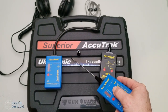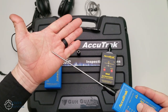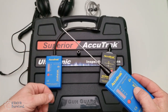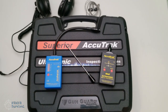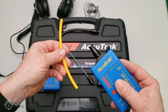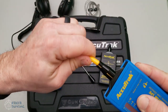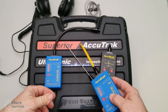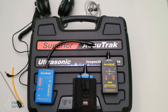With the stethoscope attachment you're able to check TXVs to verify they're feeding correctly, check steam traps to see if they're letting steam through, and check the bearings on a motor — just place it against the component and hear into it. It also comes with a plastic wand that hooks on the end to narrow down the sound area, which helps when you've got a lot of ambient noise causing background interference. If you like the video, please like, share, and subscribe — until next time, we'll see you on the next one.